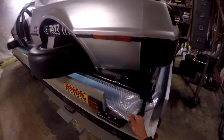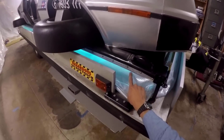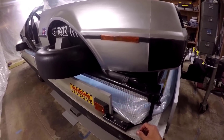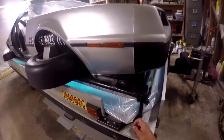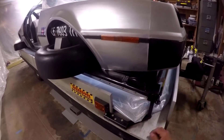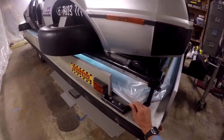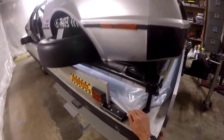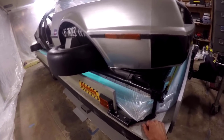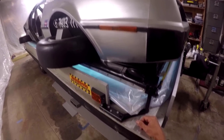This is the new skirt. For years I had a skirt that was completely clear vinyl with no fibers reinforcing it, so you could see everything and all the light would come through. You can see in some of the videos it looks super cool, but it's dangerous because if a hole happens, it can spread and get really big and you lose hover power. So I made this new skirt — it's more translucent. You can see through it but a lot of the light gets blocked by the fibers. You can still see light coming through and it lights up really well at night. I just wanted to let you know that's different than in some of the videos.